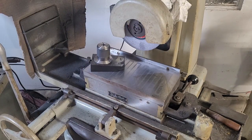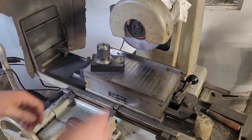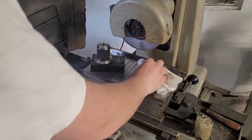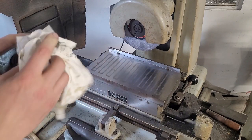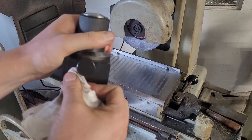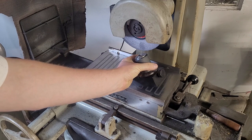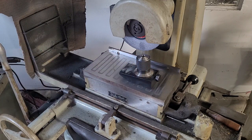The other downside: oil everywhere inside the cabinet, so they're always a mess. Now this is just an end mill sharpening fixture. You can see how it leans — so you grind the rake into your flutes and then grind in your clearance. It's a pretty simple tool with a little bit of a learning curve, but it works. I've resharpened my mills and really doubled the life on a lot of them, so it's absolutely fantastic — worth the 50 or 60 bucks.